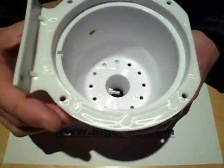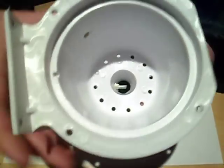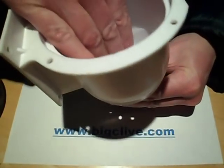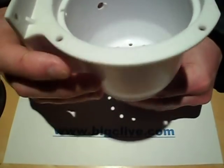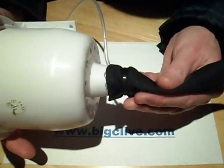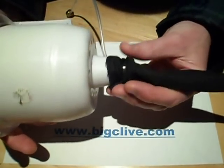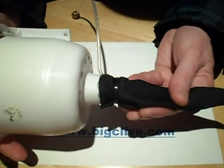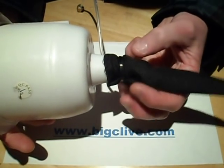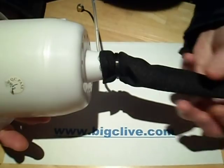Really, that's all that's in it. It's blowing into this chamber with some of the air going in the middle into the sock. You can see the pipe just ends in thin air in there and the detergent's pumped into it. What happens is that the liquid is blown inside against the outside of the fabric. And anywhere the air is basically flowing through the fabric — the path of least resistance — is where the liquid will be carried to. It then continues to push the liquid through the fabric, forming a dense foam on the surface.